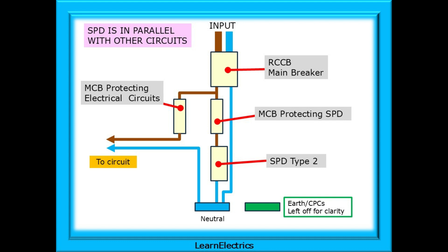If the cabling will be external to the building, a suitable cabling type should be chosen. Consider mechanical damage, UV from sunlight, and extremes of temperature in summer and winter. And that is it as far as the EV consumer unit installation is concerned. It's important that we understand where the SPD is actually positioned within the circuit. The SPD is in parallel with the EV circuit; the current for the EV charging circuit does not flow through the SPD — rather it flows past the SPD.